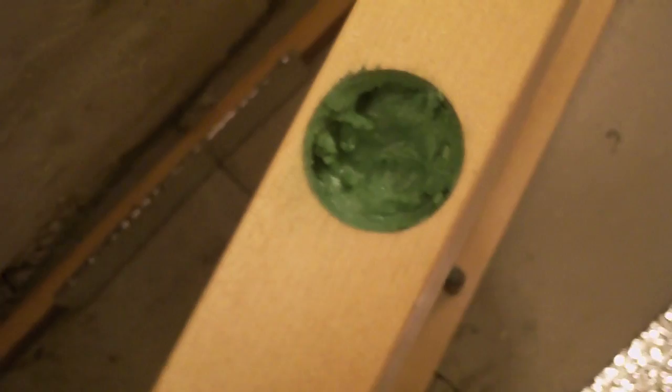Here's an interesting dilemma I ran into: I was sure this hole was sealed — positive of it — but it wasn't. I filled it to the top with epoxy and started to see it ooze out the backside. First thing I did was bail about half the epoxy out, then started adding flour — just something to absorb the epoxy and thicken it up. Once I'd added the flour it became a nice hard rigid consistency and stopped leaking on its own. Something to keep in the back of your mind: if you get a leak, find something to plug it with.